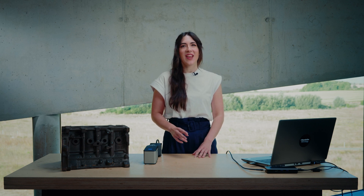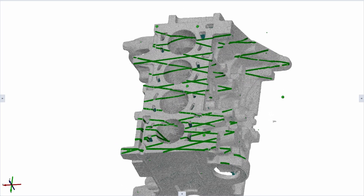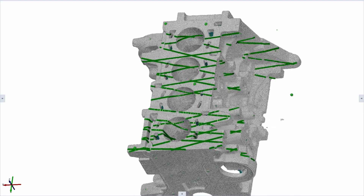In general, you can only see what the T-ScanHawk 2's cameras can see. On the one hand, this is good as we can create scan points of the highest quality. We can also detect double reflections when scanning shiny parts. On the other hand, it limits our possibilities to scan deep pockets or holes.